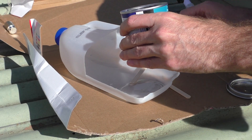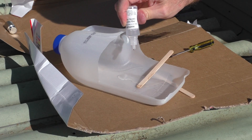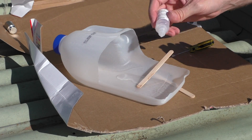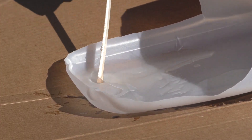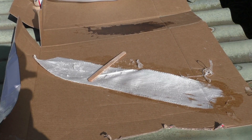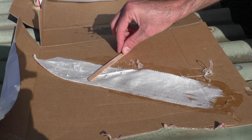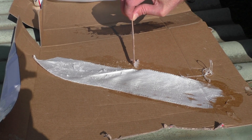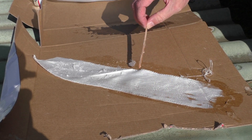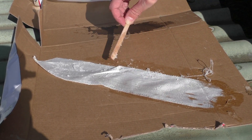That's probably way too much catalyst. I'm just going to go crazy with it this time. Well, it looks like I was a little careless with the amount of catalyst I added. Last time it took 3 days to even get dry-ish, and this time I put in a lot more. Now it's like gelatin in about 5 minutes. I took my time cutting the fiberglass piece out thinking I had lots of time, and now I just can't spread it into the fabric. It's like snot.